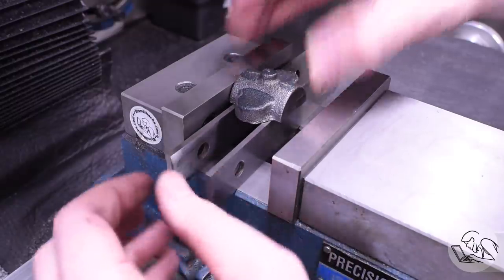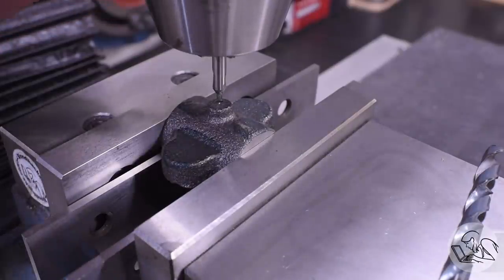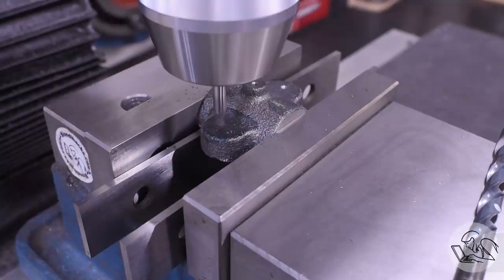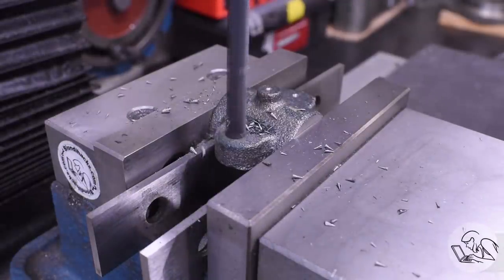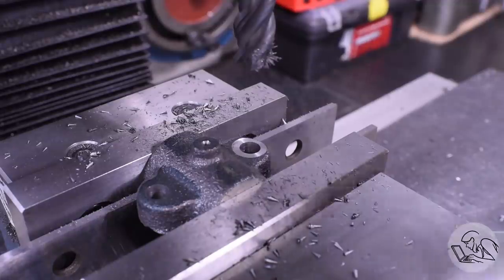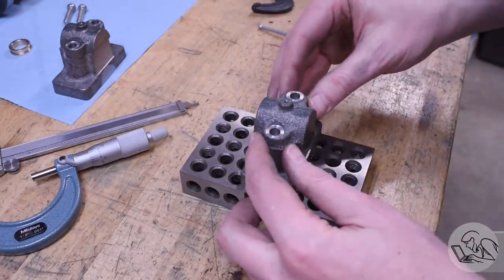The rest of this process is very much like how you would do an eccentric strap or a connecting rod - I'm going to make the bolt holes for the bearing cap and bolt the two pieces together, then do the rest of the machining with everything bolted up. I'll start by centering up by eye with a center drill on my center punch mark, then center drill the two ears for the mounting bolts using the DRO to get the spacing right. Those holes should land right on my scribed center lines - and thankfully they did. These are drilled for clearance for the quarter-twenty mounting hardware supplied in the kit. When possible, it's always nice to do a spot face on a bolt clamping surface like that on a casting because bolts don't like to clamp on a rough cast surface very well. So those are the bolts they supply with the kit - big, ugly slot-headed screws - and they won't stay, but for now they'll do for mocking these parts up.